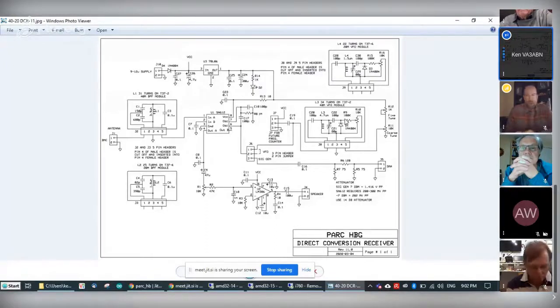And LC circuits naturally drift. Now, depending on where you're using the receiver, if it's in the house and it's the middle of summer and it's hot like hell and your AC is going full blast, that air moving through the room will change the circuitry, the frequency, especially the capacitor. All I've got to do is take a straw, blow on this capacitor, and it'll take off like a rocket. Here's another VFO, and that's for 20. I haven't tried it either. So the drift, I hate drift. I can't stand it whatsoever.